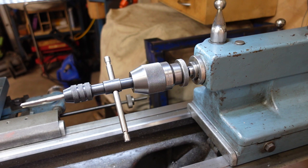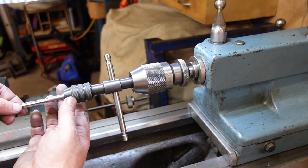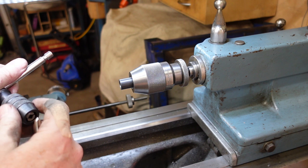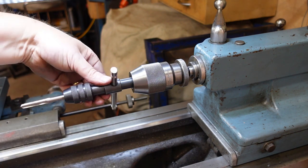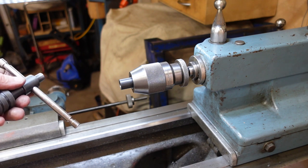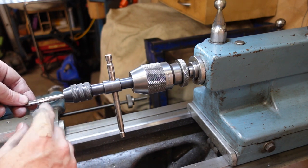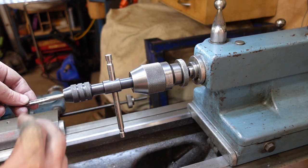This is the other method I commonly use to tap things when I'm working on the lathe — I've drilled a hole in the centre of something and I want to put a tap in. As you can see there's a fair bit of movement there, and the jaws holding this tap are only a two-piece jaw that are spring-loaded, so they can wander around a bit. So it's not really a terribly satisfactory way of tapping. The principle is good — I like the idea of the socket in the tailstock which keeps things aligned — but there's too much slop and the jaws aren't good enough.